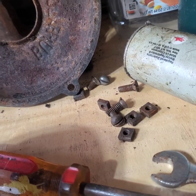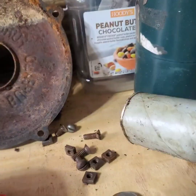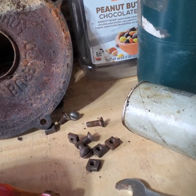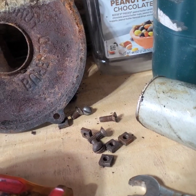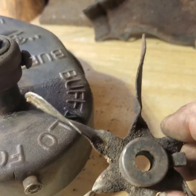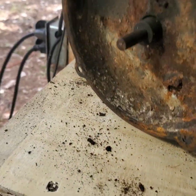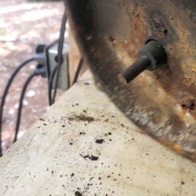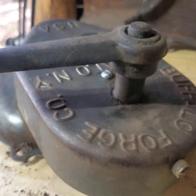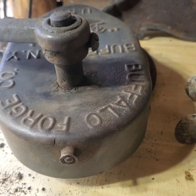And we're just going to leave the screws. I got me some grease here. We'll pop the cap off and grease it up as we're going. So let's get some more into it. So the impeller comes right off. Loosen this, and I could not believe on something that's not been apart in a long time, that come off of that shaft right there, just easy as pie. So now we're going to try pulling this here off, and then maybe that one screw's all that holds that cover on, and we'll go from there.